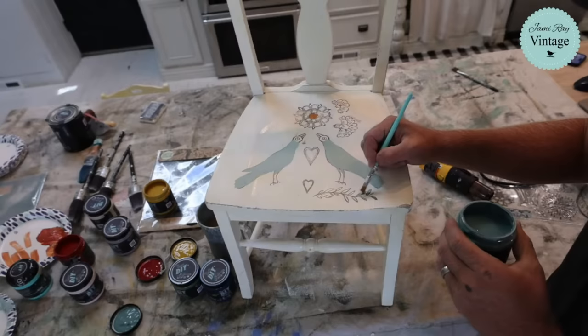If you were going to brush this, I would let it dry really, really well, like a couple of hours. Then brush the sealer on lightly. Don't overwork it. Let it dry completely and then do a second coat. Because DIY paint is great that when you get it wet, it wipes off. But guess what sealer is? It's wet. So if you take that sealer and you brush it hard across it, it'll smear it. So you just have to be delicate with that first brush.